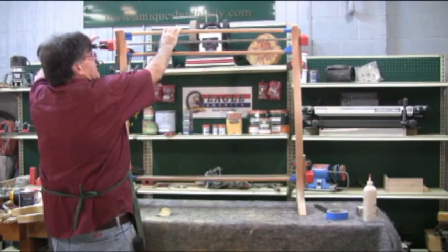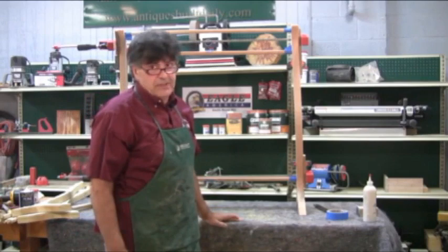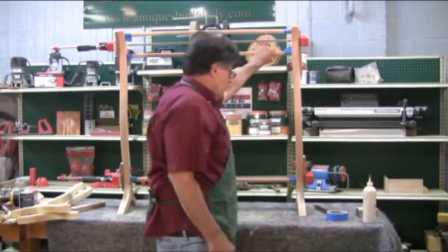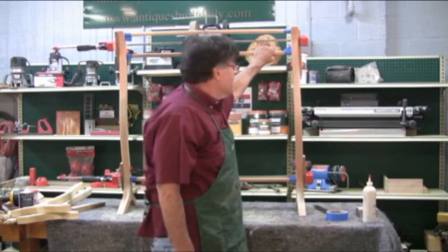Now, again, this just being me, I like those peg joints. I just do. But I've got a small tenon, and to put a quarter inch peg in it probably would diminish the integrity of the tenon. Additionally, probably wouldn't look too hot. So you know what I'm gonna do?